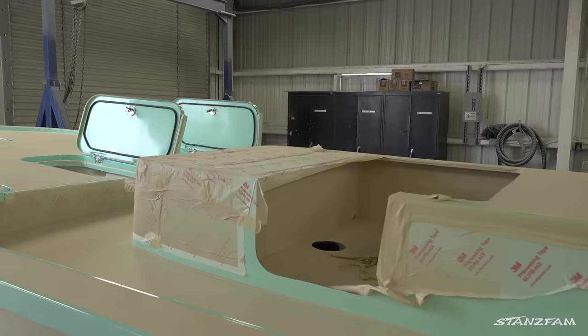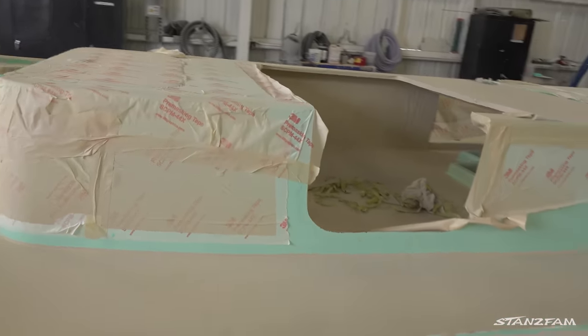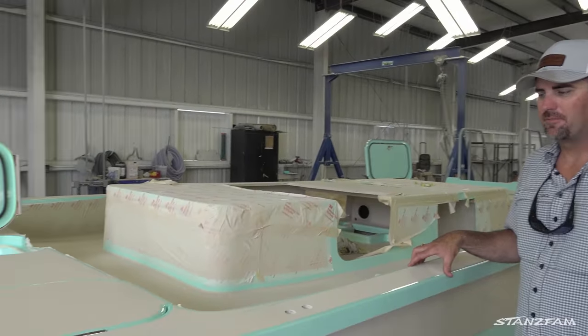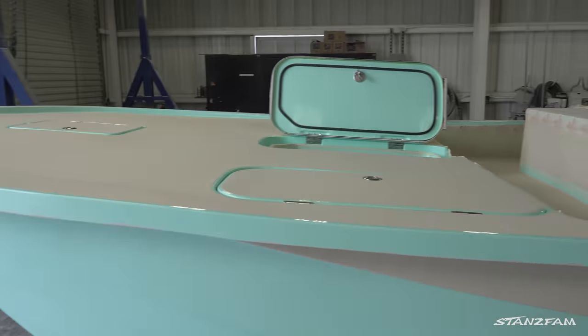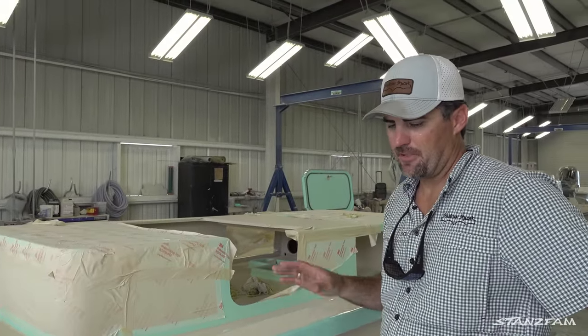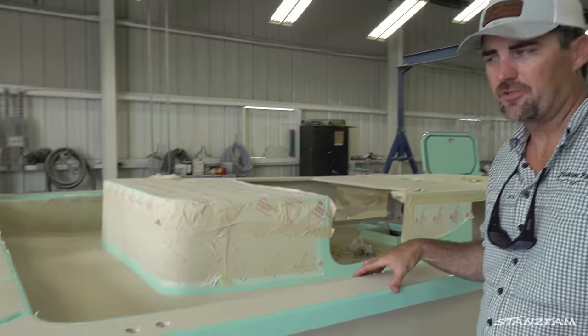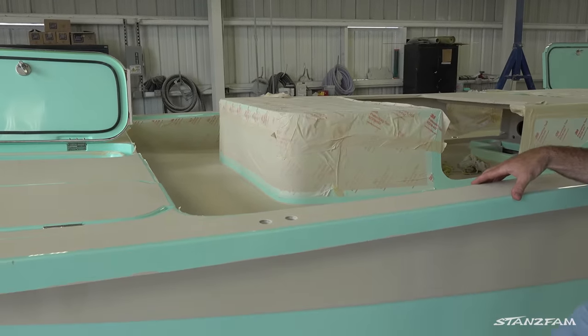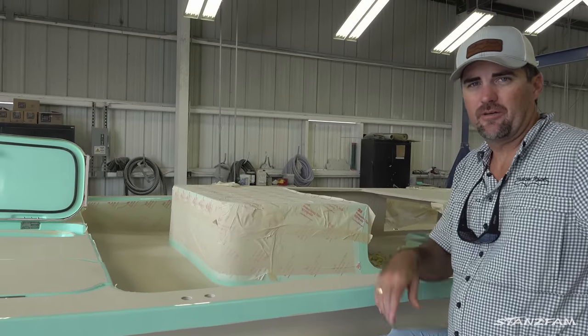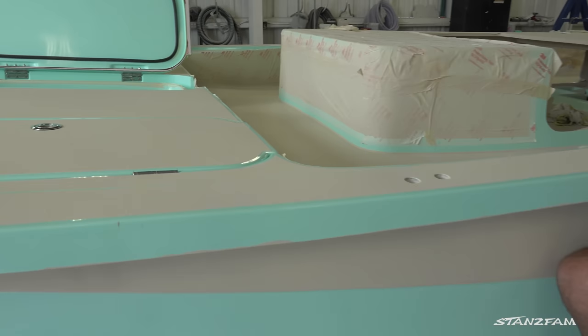Is this about four weeks into the process? This is probably four or five weeks in. Depending on the options and different equipment that goes on the boat, it can push another week or two — it fluctuates. An X3 like ours is probably eight weeks start to finish, because with a fully loaded dual top drive it takes longer to do the dual station and everything.